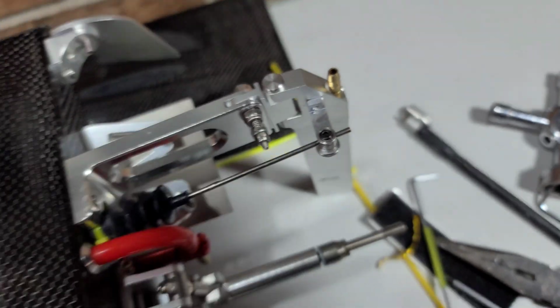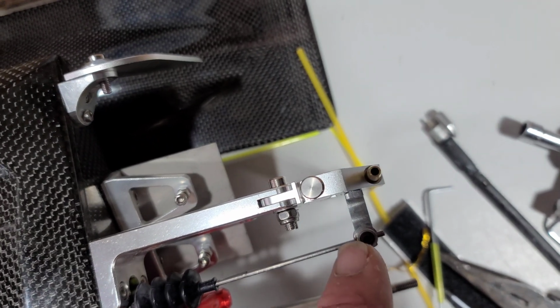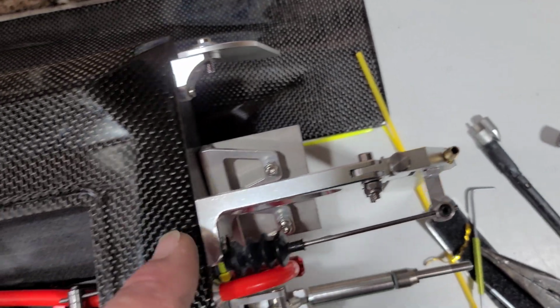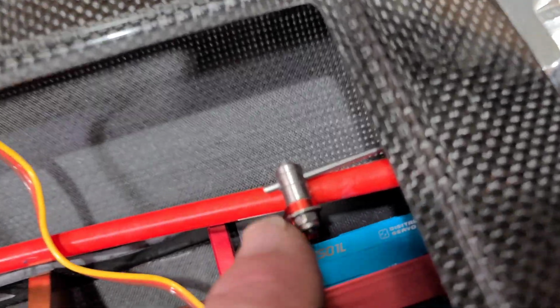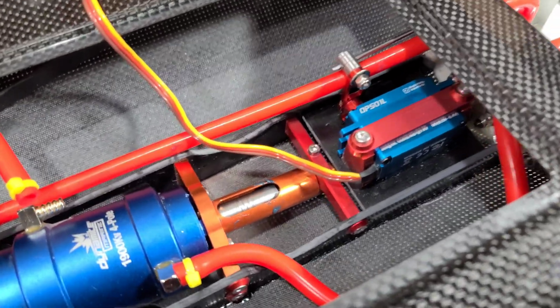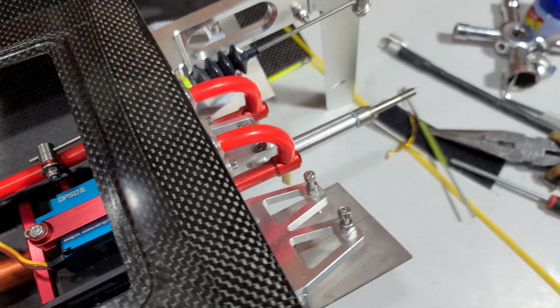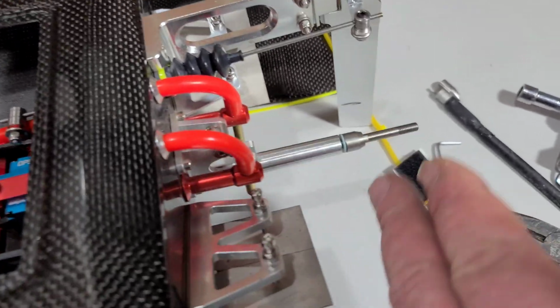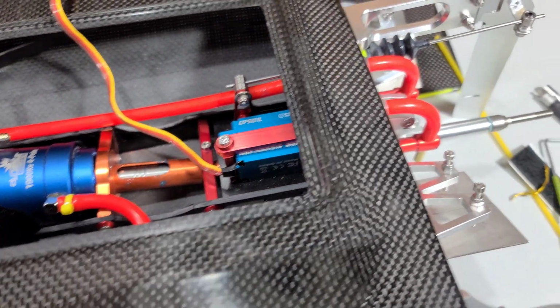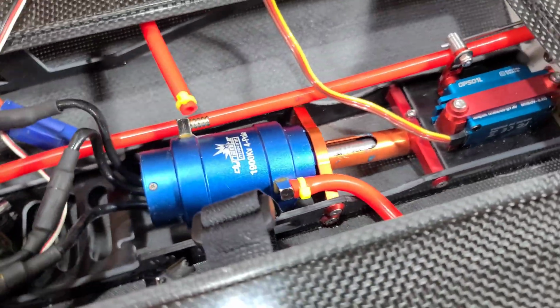Okay, it's zeroed out in the remote, and blue Loctite that grub screw with your rudder in line with the keel. I've already got this one blue Loctited. It's ready to go. Okay, let's check the throttle. Ooh, okay. Granted, I need to put a little bit more grease in the drive line, but that actually sounds pretty good. Okay, need more grease. All right.